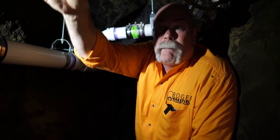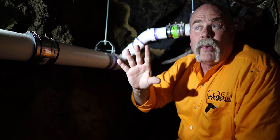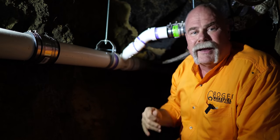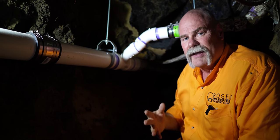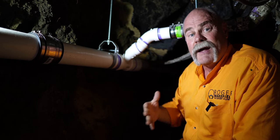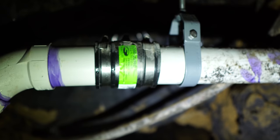Right here we put a shear band because we had to rebuild the whole toilet assembly, and getting in here and fighting everything is sometimes almost impossible. The smart thing was to put a shear band here so we could tie it all together really well. We got it inspected — the inspector came out today, climbed under the house, looked at everything with water on it, and everything holds. The biggest concern is when we come to backfill: if anything gets moved, stressed, or broken, we're going to have problems — that's what all the additional support is for.